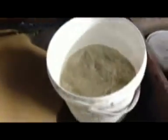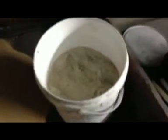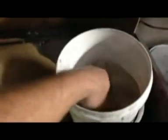Normally for every casting that I do, probably every 3 castings I'll add a small handful of both of the 2 components, just to boost the bit that gets burnt off in the sand. I will be adding this, once it's mixed up, to my original sand. You can already see some sand's been mixed in there, and it blackens off as it burns the coal components and as it burns the clay as well.